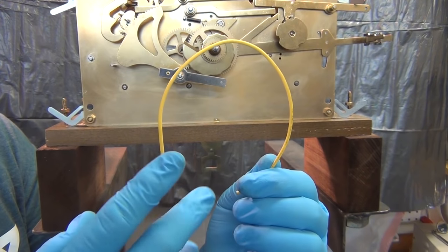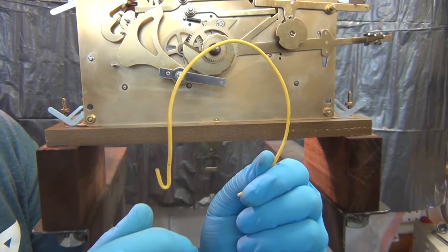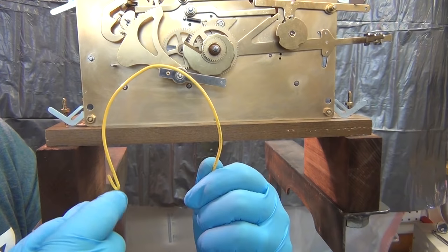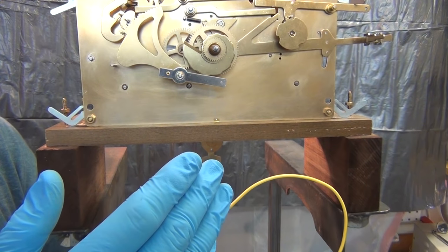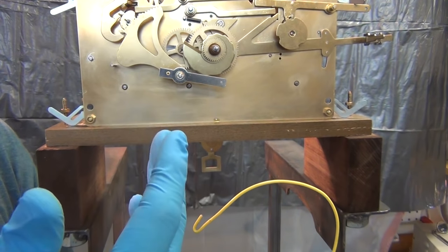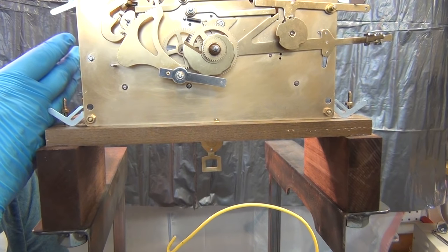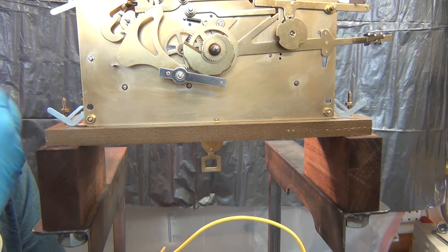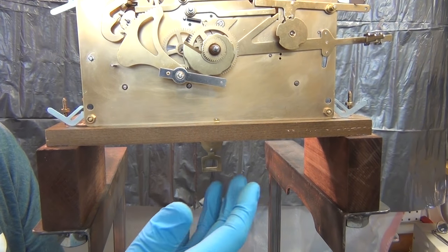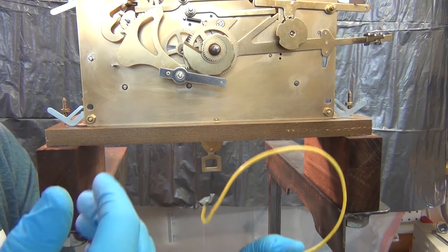To get the chain through, the best thing is to get a piece of 18-gauge stranded wire and put a little hook on one end. The object is to put it up through opposite the ratcheting direction, hook your chain on, and then pull it back through. You can do this inside the clock — it's harder because you can't access the mechanism as easily — but since grandfather clocks have side access panels for oiling and this type of work, it can be done from either side.